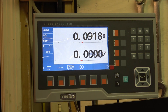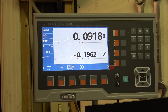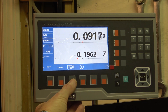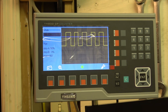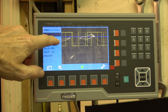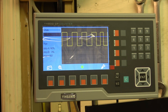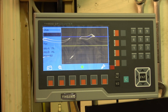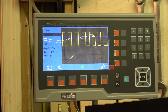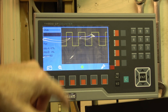Y is working properly, but now it's not working properly, and X is not working properly. Let's go back to oscilloscope mode — you can see the yellow line is producing a square wave but nothing on the blue line. Unless you get square waves on both lines, both signals from the two phases, the DRO won't work. Something is going on where the DRO is not seeing both phases.